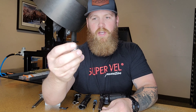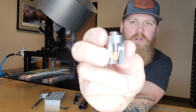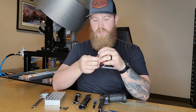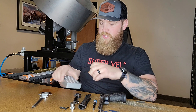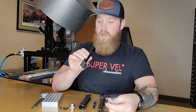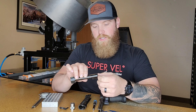I want to show you the Sheridan gauge — it's a cutout gauge. If you're on the loading bench and having issues wondering what's wrong with a cartridge, you can drop it in and the cutout shows you exactly what's happening. On this one there's a slight case bulge due to a misalignment causing a lateral bulge on one side. This gauge is at minimum spec, so it catches that. Atlas is smart enough not to build their chamber at minimum spec because that would cause reliable feeding issues.